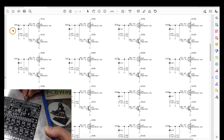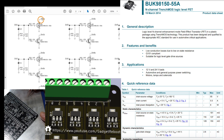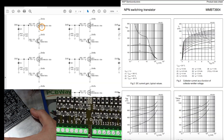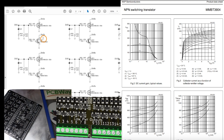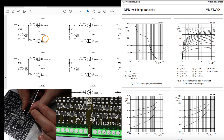Each channel's driver circuit has three functions. There's an onboard LED to indicate the on/off state of each output. There's an open drain MOSFET connected to an output screw terminal, capable of switching a load a couple of amps to ground. And there's an open collector NPN transistor, capable of switching a few tens of milliamps to ground as a lower power low side switch.